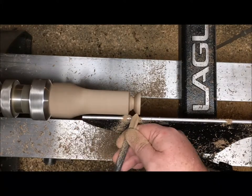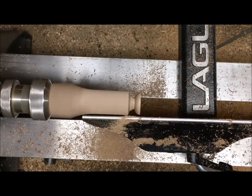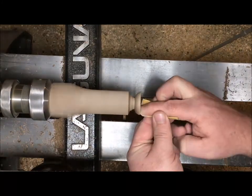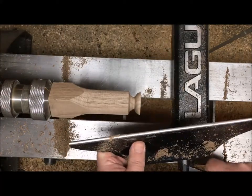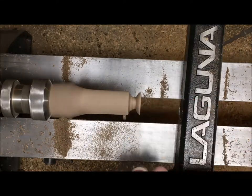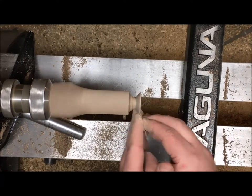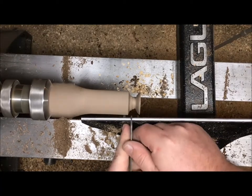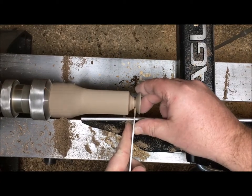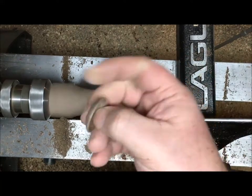While shaping the outside I thought I could just measure the wall thickness by feel and I wouldn't have to worry about the depth, but as you'll see I did have to worry about the depth. So a little sanding, and I decided to go just a little bit thinner on the wall thickness. With a narrow parting tool we're going to get ready to part that off, making a series of straight cuts just widening them out — and oops, you'll see what I did wrong: there's a hole in the middle.